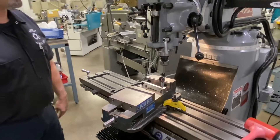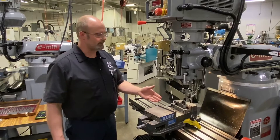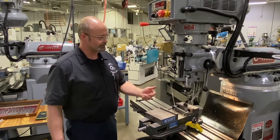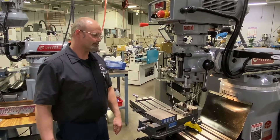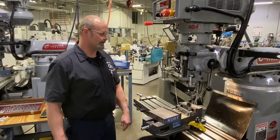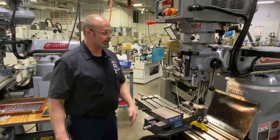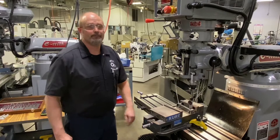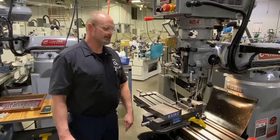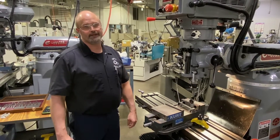So this is just a quick little procedure on how to make sure our vise is indicated to a specific angle — in this case, it's 10 degrees. We did the gauge block build up, we used the sine bar, secured it with some magnets, using our test indicator to verify that position. So I just want to thank you for joining in. If you like these videos, hit the subscribe button with Practical Machinist. Any questions or ideas for future videos, let us know in the comments. And we'll see you next time.